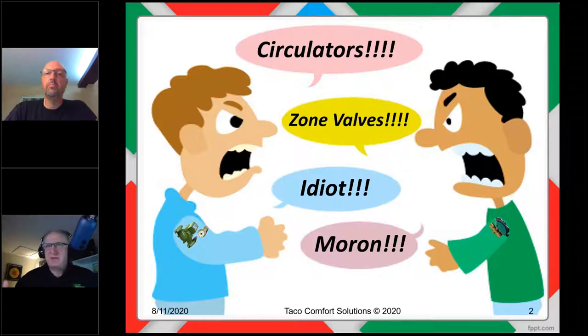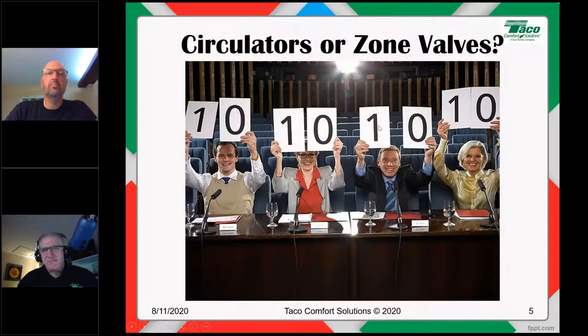And it's interesting because both sides have very specific arguments on their side. And in reality, if you're just simply talking about delivering BTUs, all right, keeping people from freezing to death, both are a perfect 10. Nobody's going to know the difference. There's not a person within the sound of my voice on this webinar or anywhere on the World Wide Web, or if I open up the window and shout it out, there's not a person out there that can walk into a house in the middle of winter and say with any amount of certainty, yeah, that feels like zone valve heat to me. Or that feels like circulator heat to me. There's really no difference, okay? Designed and installed properly, there's no difference in terms of delivering BTUs.